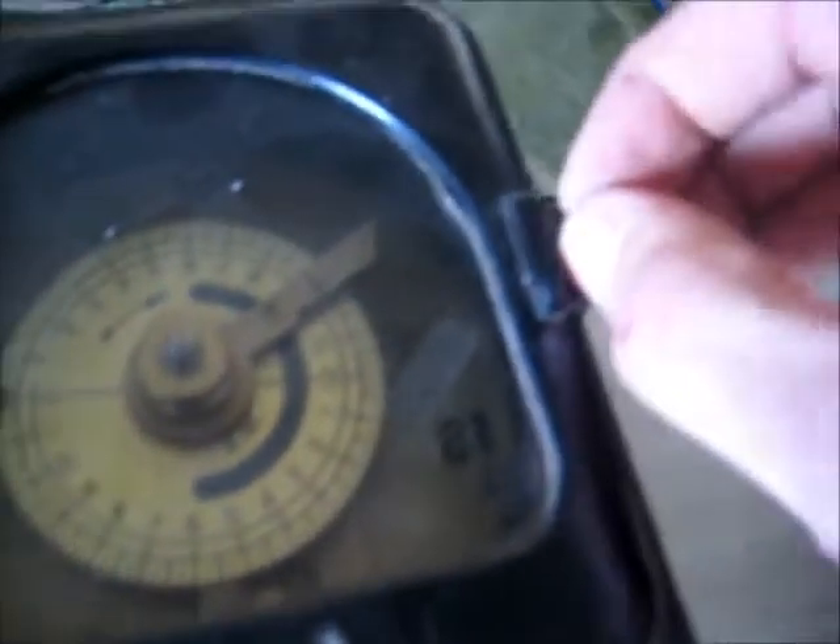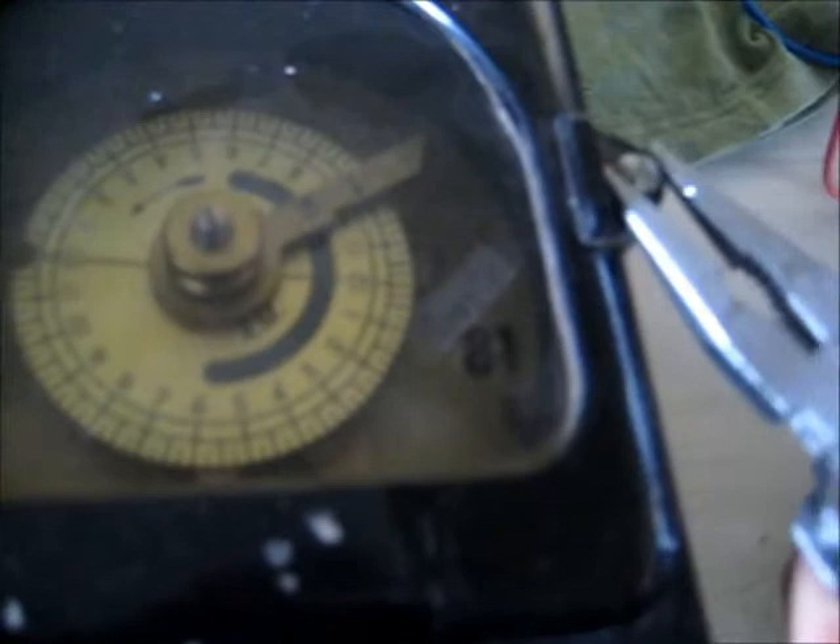First, I'm going to take this off and try to set it so we can get it to trigger. It's got '81' — so I think it was last tested in 1981. It's got '5/81' on it. It's got 'hand wind', so this might have a spring reserve in it. This is a one-way screw, so I'm going to have to get this screw off. It's a bit hard to undo. If you listen, it's kind of unique. It's got this little regulator adjustment here — marked 'Regulator R'.